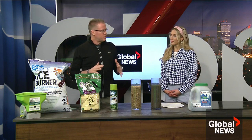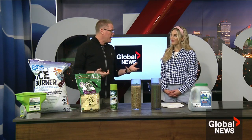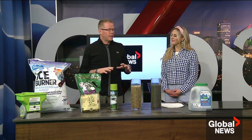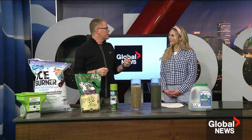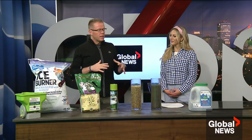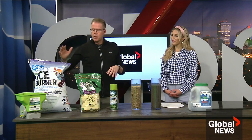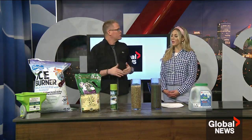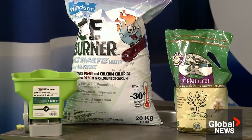If it's not super cold, sodium chloride is cheap, but for a few bucks you're wrecking everything else and it's not worth it. Typically you're going to want a calcium chloride or magnesium chloride product. These are more effective at colder temperatures — a product like this is effective to minus 30 or even below, which is really the top end you'll see for ice melt products.